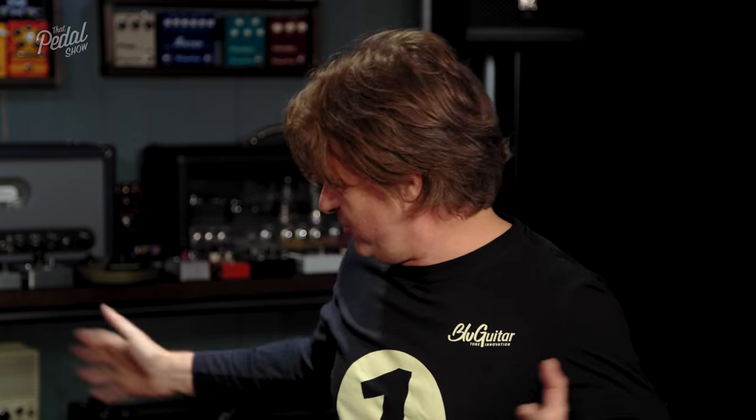And actually, by lowering the voltage, all the tubes will be at a different point of the curve because their voltage drops too. And that's a totally musical effect, which is phenomenal. Eddie Van Halen, all these sounds are based on these effects, and all the cranked Fender amps and blues amps, this is where the magic comes from.